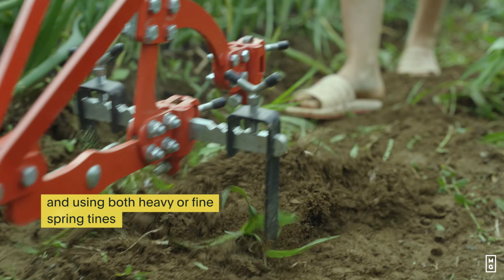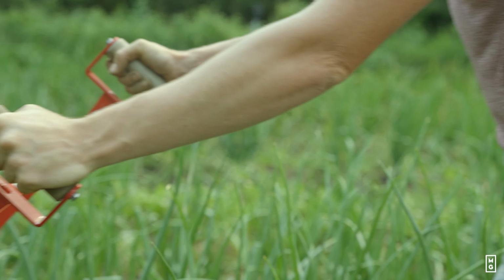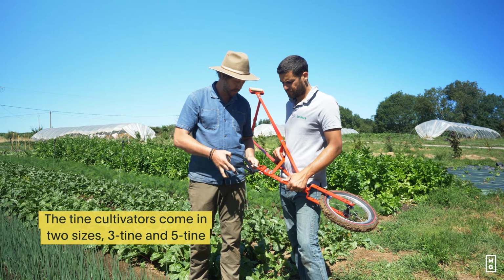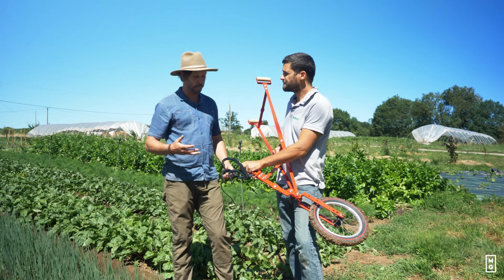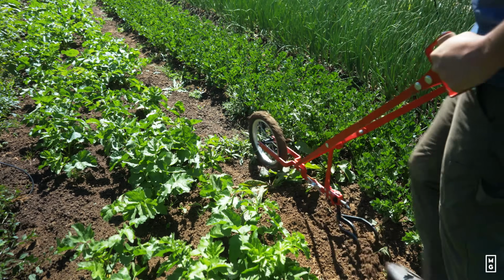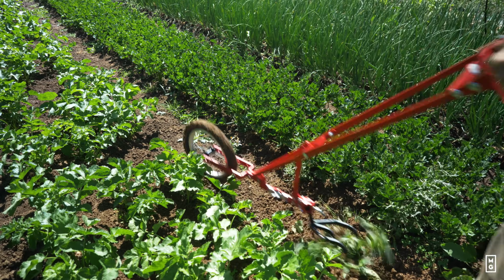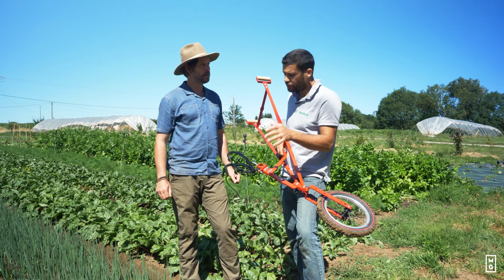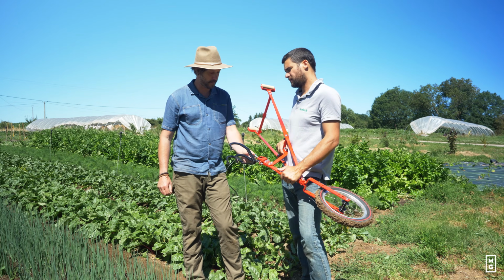Yep. And the last one you want to show me is this harrow, a 3-foot harrow cultivating tool. So it's the same setup. Goes like this. And this one would be more for decompacting soil? Yeah, decompacting, or here the soil is very soft. But if the soil is very heavy and compact after a huge rain or whatever, this one really opens the soil much more than a blade. Okay, easier than a blade. Great, makes things easier.